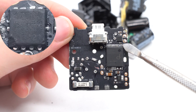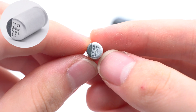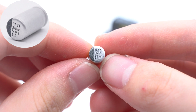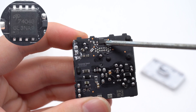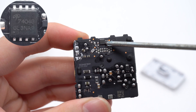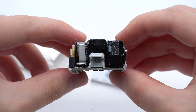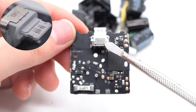The synchronous rectifier is from Toshiba, 100V, 9.8mΩ. The solid capacitor for output filtering is from Nichicon, 12V, 560μF. The output VBUS MOSFET is from AOS and adopts a DFN 3x3 package, 20V, 4.4mΩ. Finally, the USB-C receptacle is reinforced with a metal plate and fixed with a plastic frame.